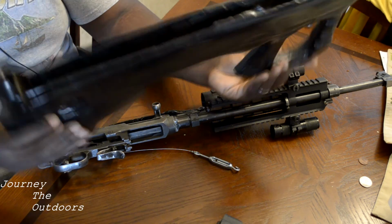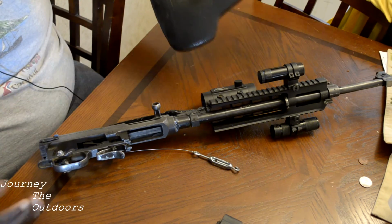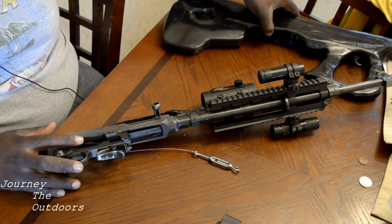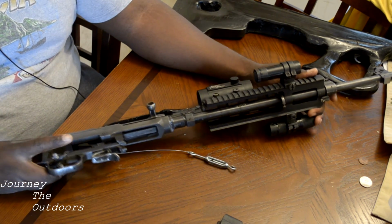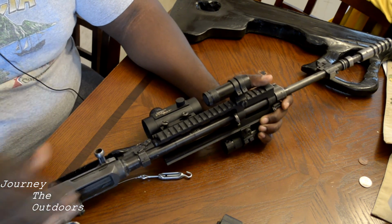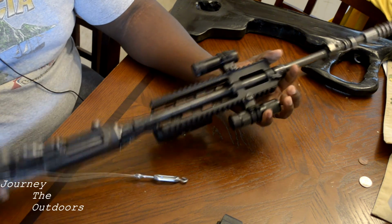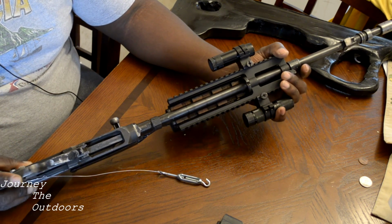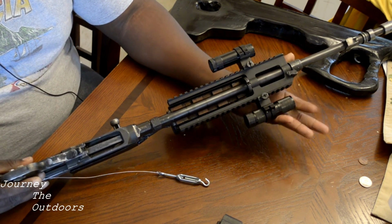and it just goes straight through. That's the great thing about the SKS. It doesn't require too much heavy carving. It's mainly inletting enough that it doesn't touch anything. By that, I mean the receiver and the trigger group are self-sufficient, so as long as it has space, it'll fire every time you pull it.